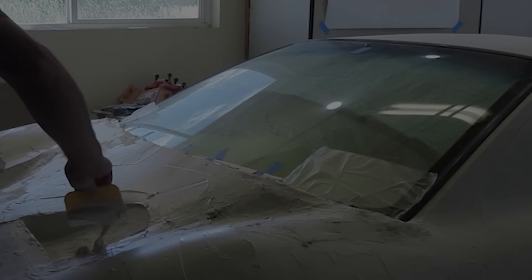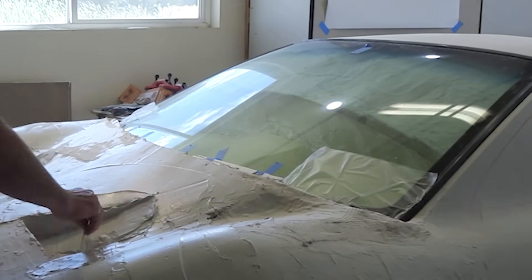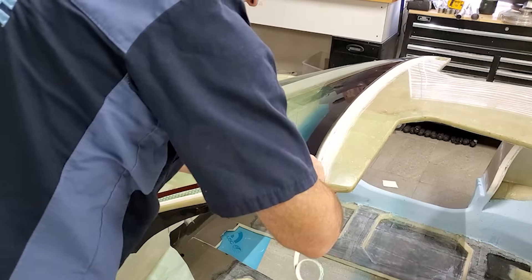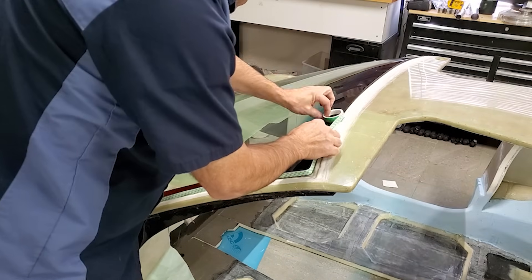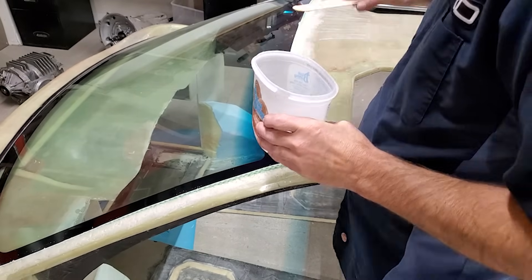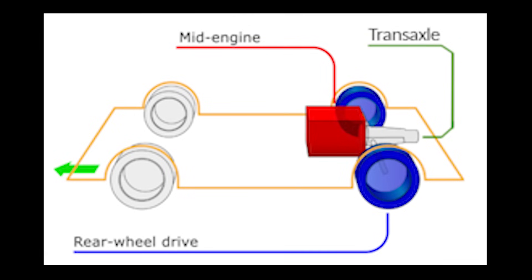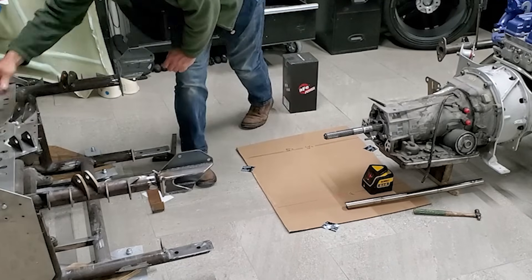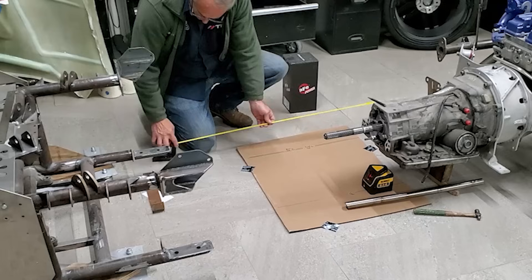Let me give a couple of good examples. The windshield is from a 90s-era Chevy Cavalier — I could afford the $120 for that windshield but not the $10,000 to $20,000 for a custom one. The trade-off is that I had to work my design around that windshield. The same consideration applied to the drivetrain. Most longitudinal mid-engine cars use a transaxle setup, but even sourcing a used Porsche transmission that can handle 600 horsepower might cost $9,000 to $12,000 on the low side — half my budget.